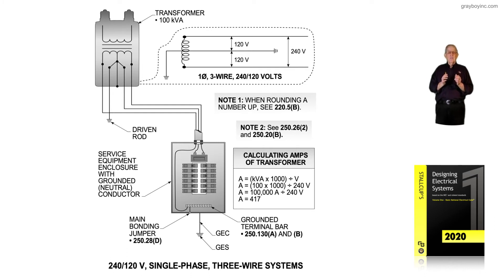We shouldn't be changing conductor sizes as electricians without going back through the approval of the designing engineer or contractor. This is added information for anyone designing, installing, maintaining, or inspecting. Now if table 250.66 is used to size the grounding electrode conductor, all grounding conductors in that panel board have to be at least the same size — the same size grounding conductor, bonding jumper, and main bonding jumper.